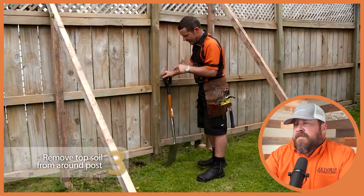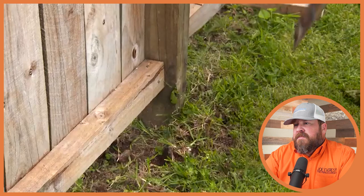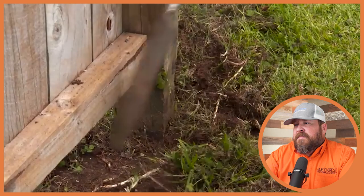Before removing the post, the Miter 10 host takes a little topsoil off to expose the top of the concrete, which makes it easier to remove the post. The reactor notes this means the post was buried below grade, or the concrete ended below grade — there were two or three inches above the top of the concrete before reaching ground level. He references a past video review about bringing concrete above grade, and notes that many folks slope concrete away from the post so water doesn't pool there, keeping ground contact off the post where rot typically happens.